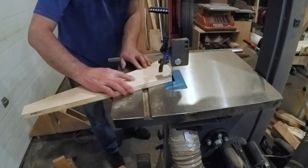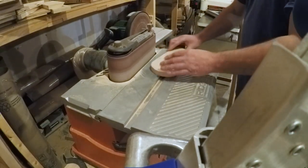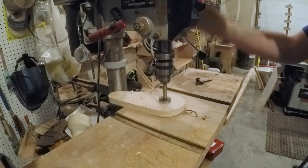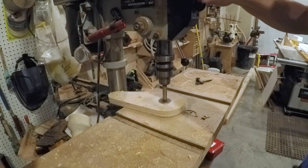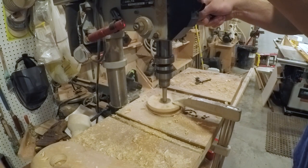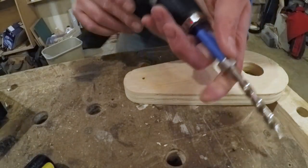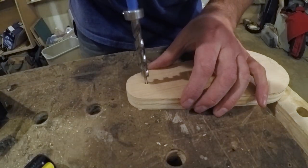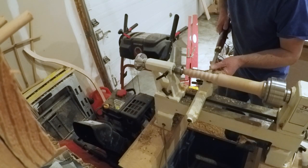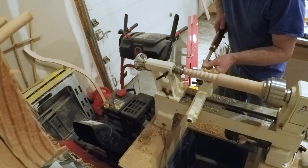I cut it out at the band saw, then some more spindle sanding to clean it up. I drilled a hole in the swing arm to allow the closet rod to pass through and did the same thing on the keeper rings. I used my pocket hole step drill bit instead of a proper countersink bit to countersink for a screw to attach the handle, and I made the hole a little wider than the screw so the handle would spin freely when in use. The last piece to make before assembly was the handle itself — I used a piece of scrap maple, made it round, and turned a few finger grips in it just to get a little fancy.